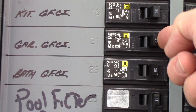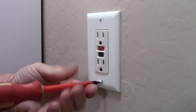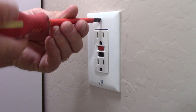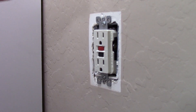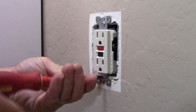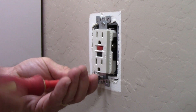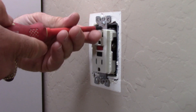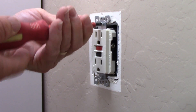So let's get started. First step in any electrical project: we've got to shut off the power. Now with my breaker in the off position, we're going to remove this device from the box, pull out the receptacle, and test for power when we turn the breaker back on to make sure there is power here. Then we'll use my meter to test for power on the line side terminals of this GFCI receptacle.